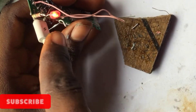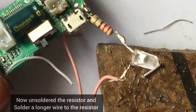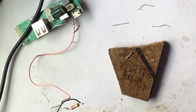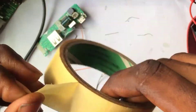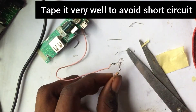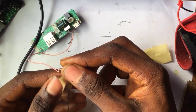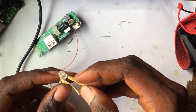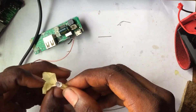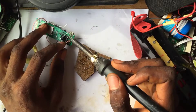Let's test it — you can see it's displaying. Now unsolder it and add a longer wire to the resistor. Then get your tape and tape those components so they won't short circuit on the PCB board. Carefully tape it, then solder the negative terminal back to the negative terminal of the charging port.